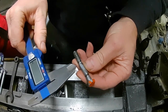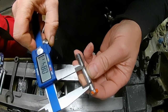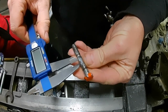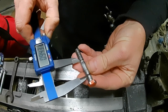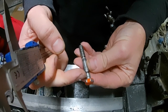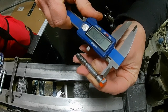The other thing we have to look at is this distance — in this case just shy of an inch. We know that our inner shaft is about an inch, so this distance is important because when these things shear, you want them to shear off in the inner shaft. You want the parts outside of this area to be in your outer sleeve — there are two shafts in a shear bolt application.